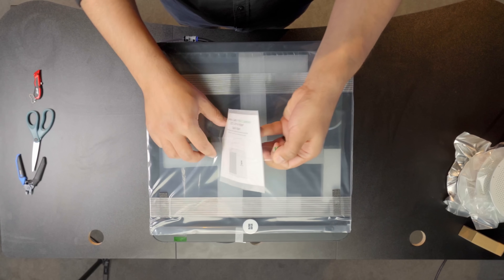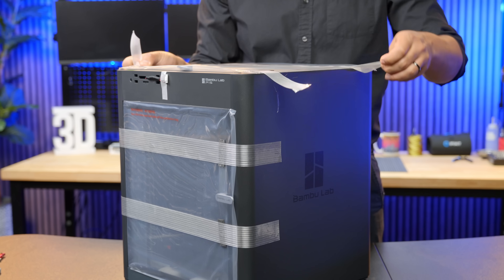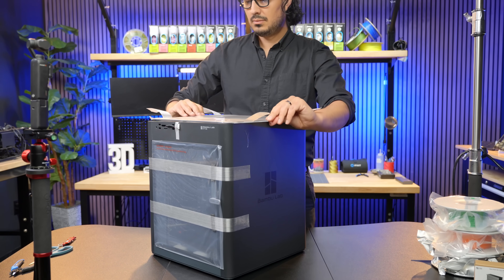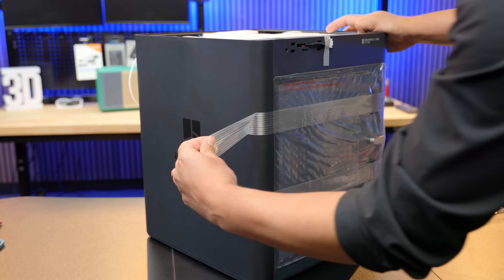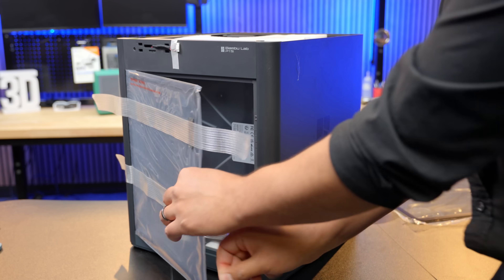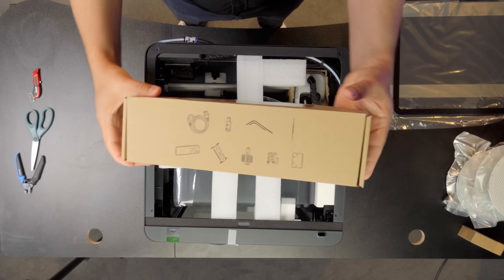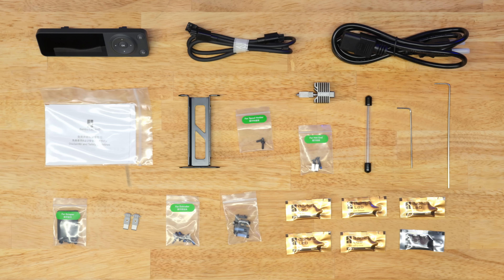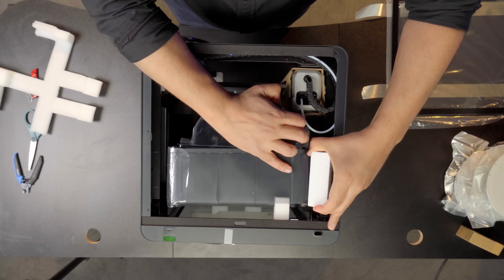The manual will be sitting on the top of the printer. Familiarize yourself with the steps of the build process. Carefully remove the plastic tape around the top panel, then flip the top panel upside down and remove the plastic wrapper on the panel. You can now set the top panel aside. Remove the plastic tape around the front panel, open the front panel, and carefully remove the plastic wrapper. Remove the cardboard box inside the printer — this is the parts box, which contains everything you'll need. You will need the Allen Key H2 tool in future steps, so make sure to take it out of the parts box. With everything set aside, remove the foam pieces sitting on the top.